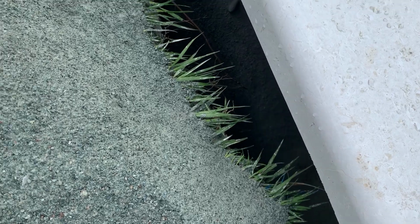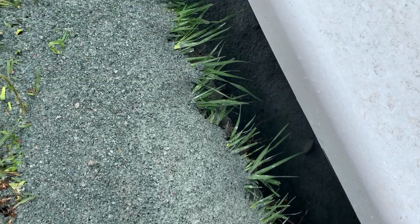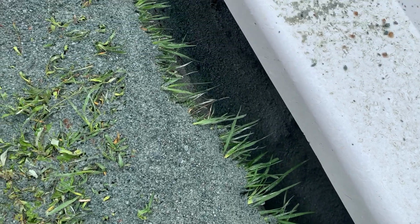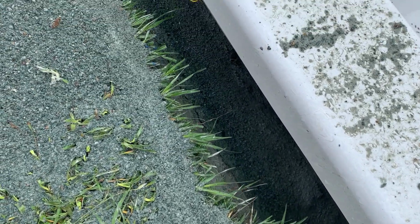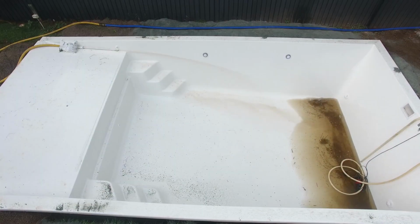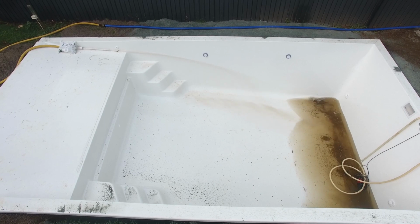So before the water goes in, get a little bit of backfill material around the pool, and then when you start washing that backfill in, the first part, or the only material that's going to be around the pool, is backfill, even if the walls start to cave in after that, which definitely can happen if you're in a sandy site or some other sites where the materials do move around a little bit more.